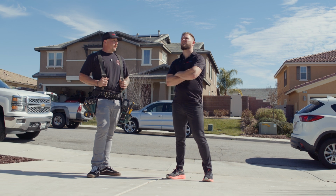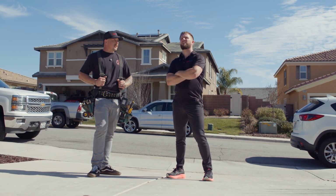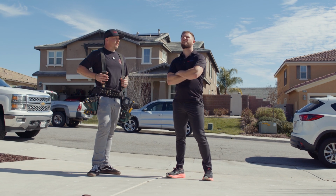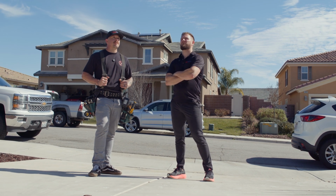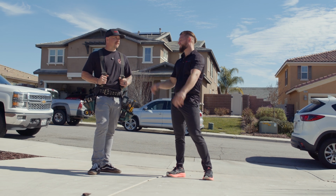That's an issue that you have to bring up with the customer. I typically bring it up at the beginning of the job, letting them know that this is where we're at with venting. You can add more venting in the future, but we can get the install done now. You're still using your fan, it just won't be at 100% efficiency. Okay, so we can use our fan and experience the benefit of it and consider adding more ventilation at a later time to optimize the airflow?